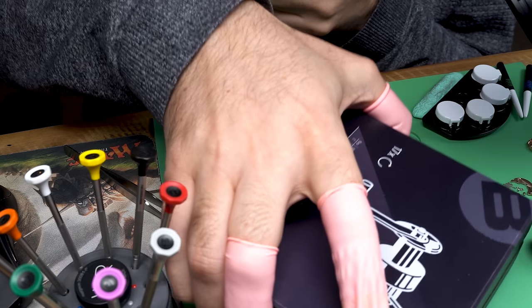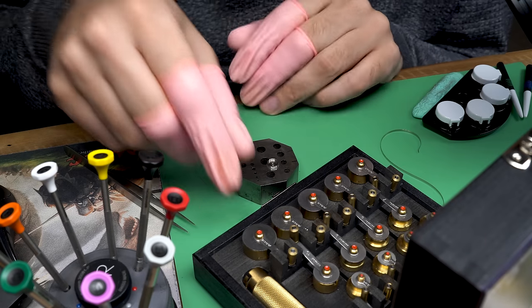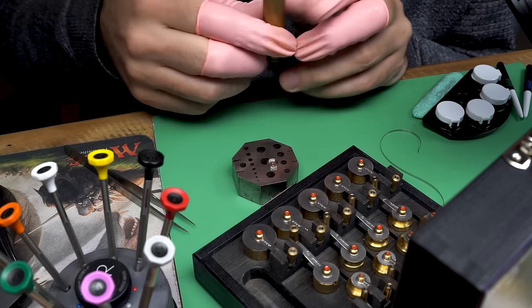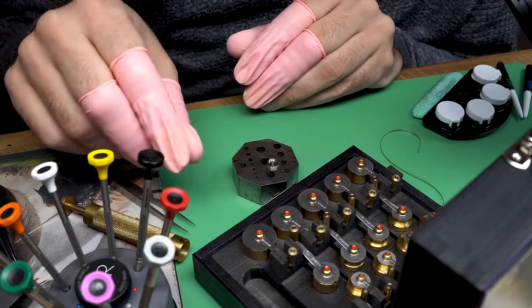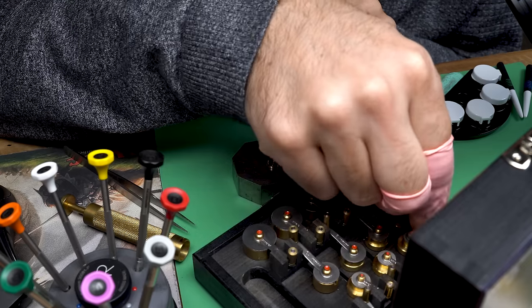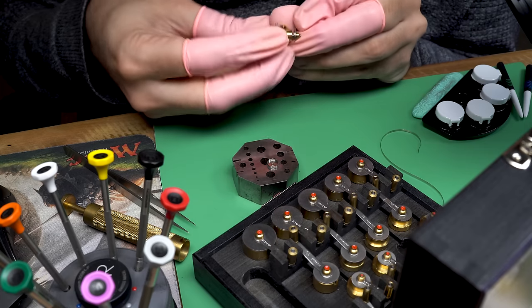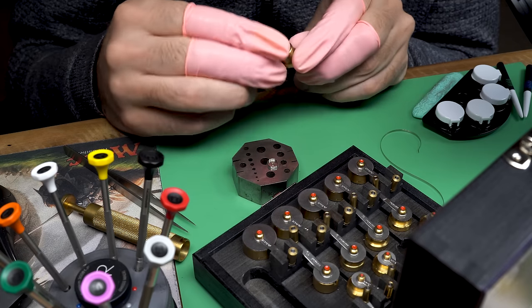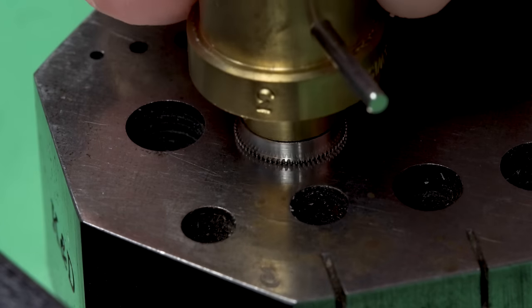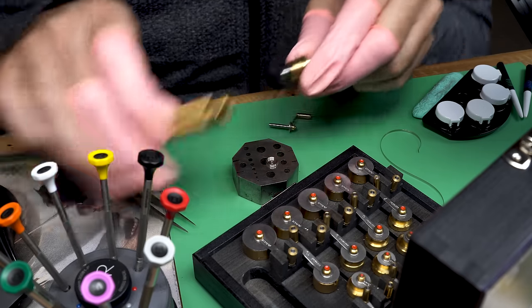So first things first, let's get the barrel, spring, arbor, and lid all reassembled again. That's going to be the power source for the watch. Basically anything on a watch that moves, tells time, tells the date, does a moon phase, anything like that is going to be powered off of one spring. And all the watch does, it's kind of weird, is it controls how fast that spring unwinds. That's what a watch does. That's how it works. And that spring is the mainspring.